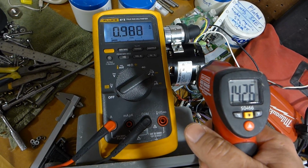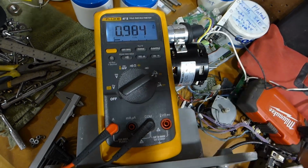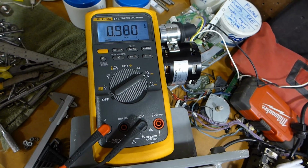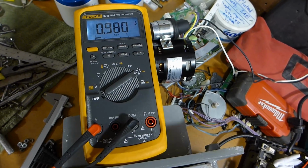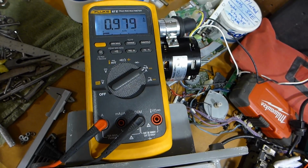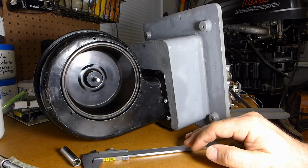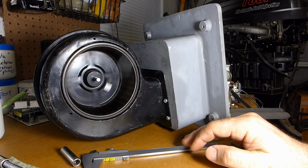And taking a current measurement, so we're right at 1 amp. And there's not a lot of headroom on the transformer for powering the 120 volt circuit. So I think this right here will just squeak in. I think the original motor was spec'd at around 0.8 amps from the best I can decipher reading on the internet. Man, I can hear the fearmongers now talking about how I'm going to ruin the brushes on my DC motor by overcooling the lathe now.